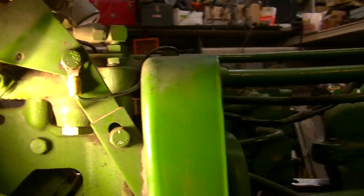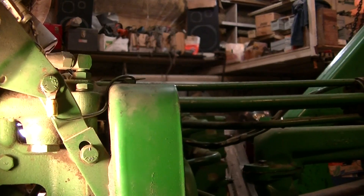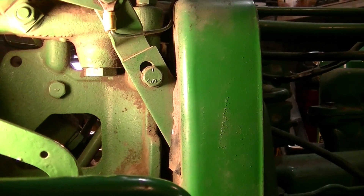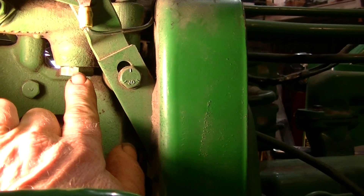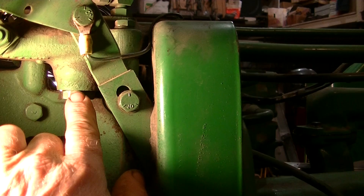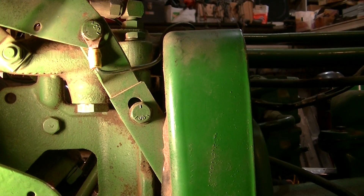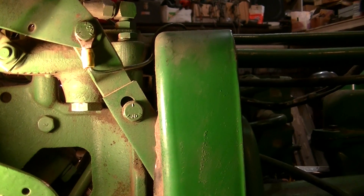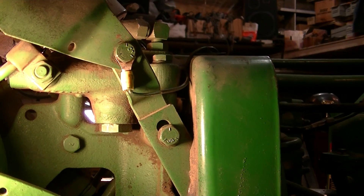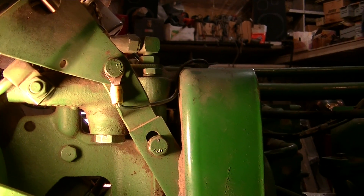This is called a priority valve. This takes the oil and, if there's a problem with the hydraulic system, it makes priority for the steering and brakes. You can see this little bung down here — this is where you would normally tap in for a loader. You'd put a closed center control valve in there, and it still works the same way: priority for steering and brakes, but everything else goes to the loader, bypassing all the other remotes. That should make the loader work better. That's about it for the hydraulics and the adjustments thereof.